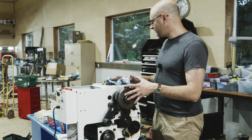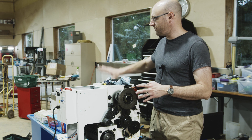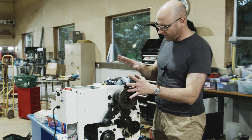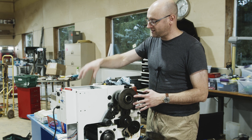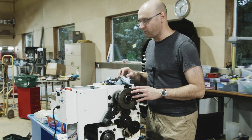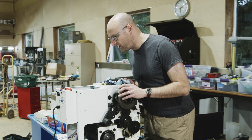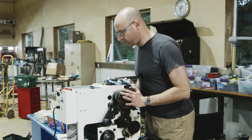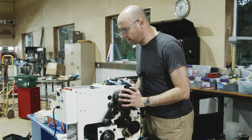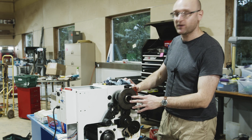I think I've got most of the easy stuff off here — it's taken off a bunch of weight. I've taken off the tailstock, the compound slide, some covers. What you saw me do then was remove and detach the BLDC motor from the electronics box. I've had a bit of a poke around in here — there's a little Atmel chip that acts as the microcontroller. I don't think this will be too hard to convert to 240 volts. Maybe easier said than done, but it shouldn't be too much of a project.